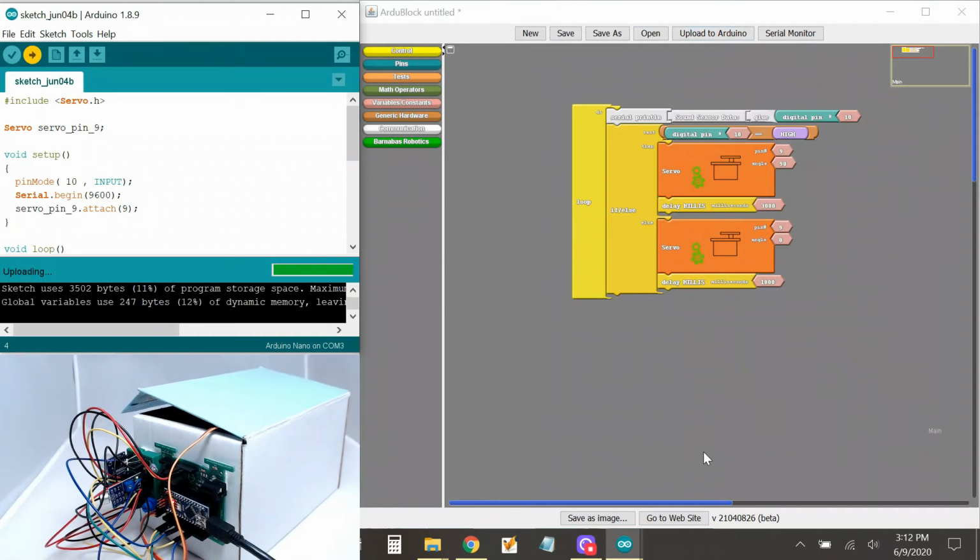It should help us. Hello. Hello. Oh, but now we have another problem, I think. So that's not going to work either. The reason that it's not going to work is that your code's looping, okay? Whenever it starts here, it says, is pin 10 high? Do I hear something? If so, open the box, stay open and then close. Now, what if it goes from the beginning and says, do I hear anything? If it doesn't hear anything, it's gonna jump down here.